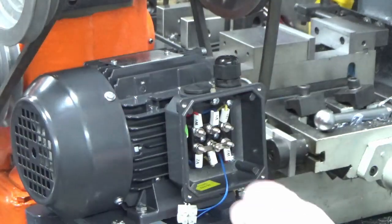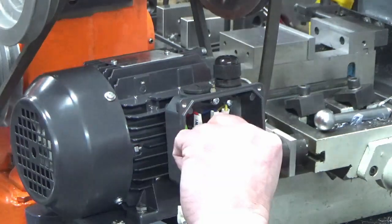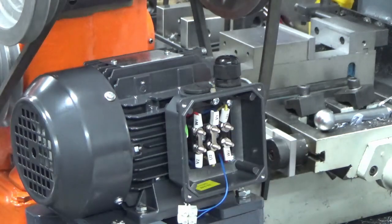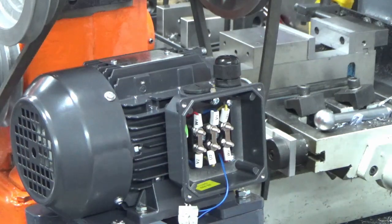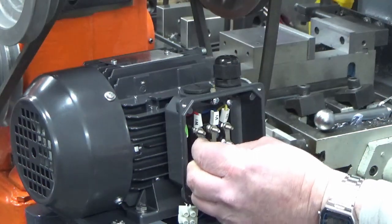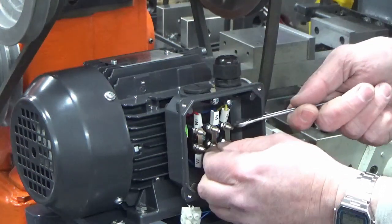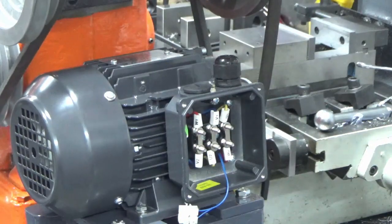That's the mechanical bit I understand done - nuts, bolts and washers. Now for the bit I don't really understand, which is changing from star to delta. I think I can put the bottom set of hardware back on, and when my wire comes in I'm only going to be connecting to the top terminals: U, V and W. I'll bring you back when that bit's done.